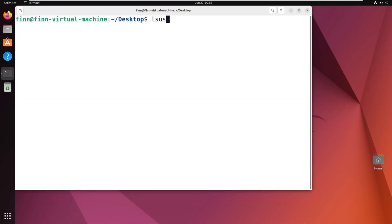Now let's help our Linux users. You will need an Intel or AMD Linux PC, because the upgrade tool is closed-source and provided in an x64 architecture by Rockchip. I know there is an open-source tool called RKDeveloptool, but since the image Chipsy provides is in Rockchip firmware format, which RKDeveloptool does not support — as far as I know, RKDeveloptool only supports RAW firmware format — we have no choice but to run this program on an x64 Linux PC.